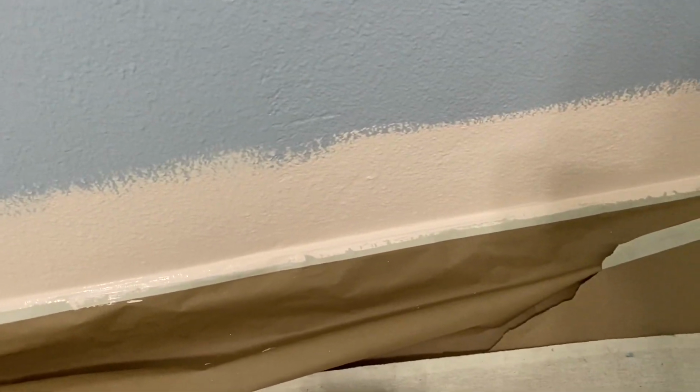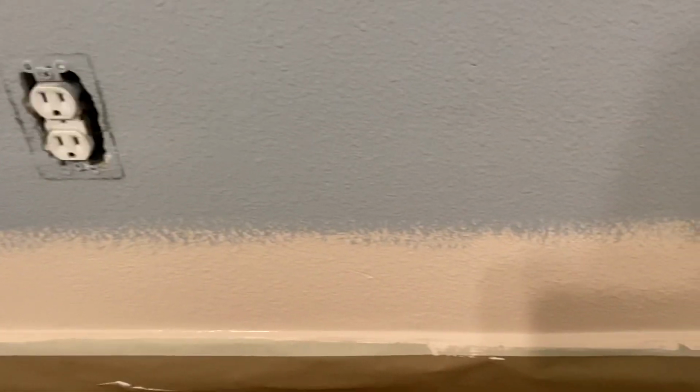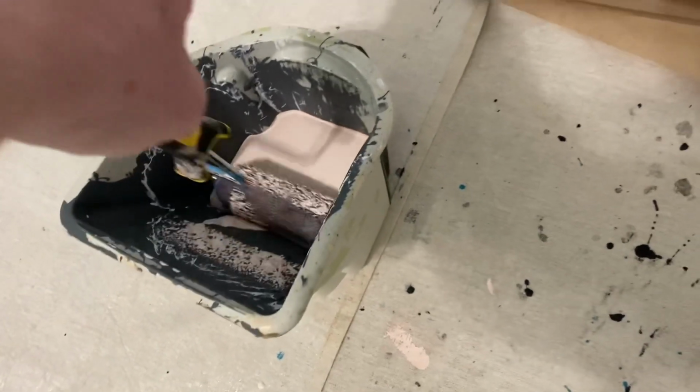Now, what about making the paint stippled the way the roller is going to make it? How do we do that? We have to be consistent. The brush helps us get the paint in this corner, but it doesn't help us match the texture with which we are applying the paint. Our brush makes it smooth. Even though you have texture under there, the brush, and you see the stroke marks? See that? That's what's happened down here. But if you want to make it right, which if you're a professional, you have to, you want to imitate the stipple.